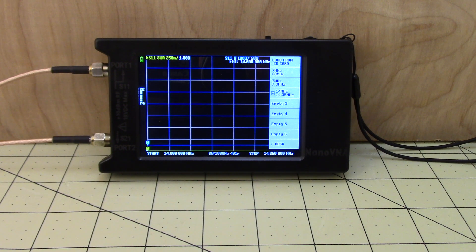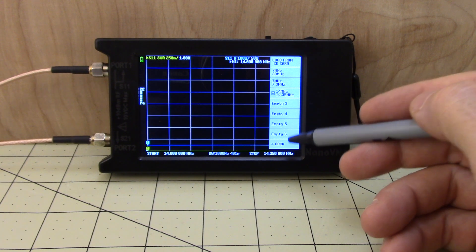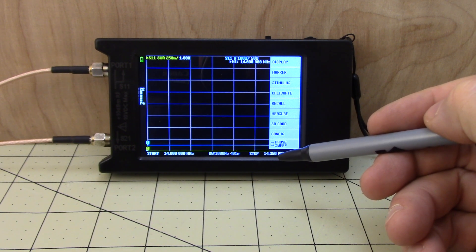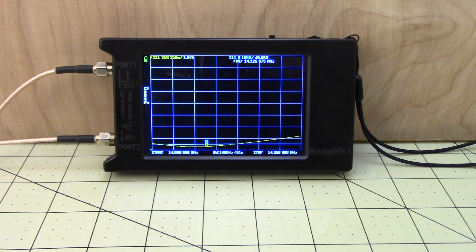That's the steps you go through — just repeat those steps for each band you want to store, and make sure to save after each one. That's how you get simple SWR and resistance readings for your antennas. For most of us using these as antenna analyzers, that's how you set it up — just a few steps, not that difficult. If you learned something, please like, comment, share, and subscribe. There's also a link to buy me a coffee to help expand the channel. Thanks for watching — this is Kilo Mike 4 Zulu Kilo Bravo, have a blessed day.